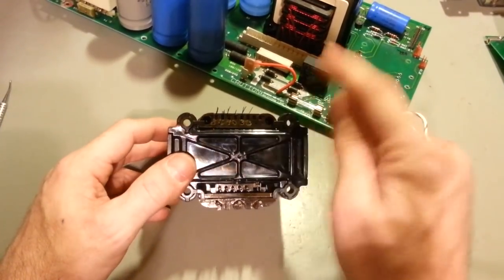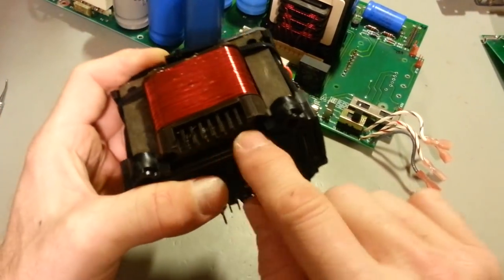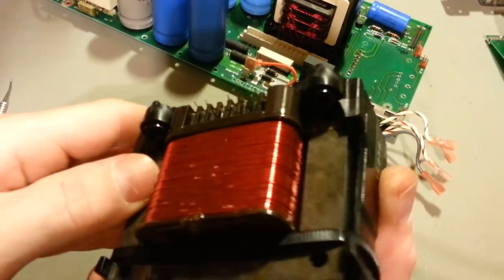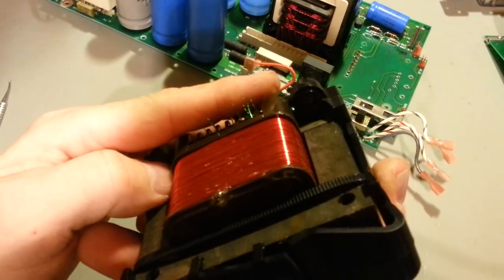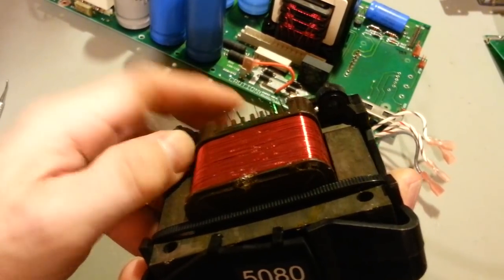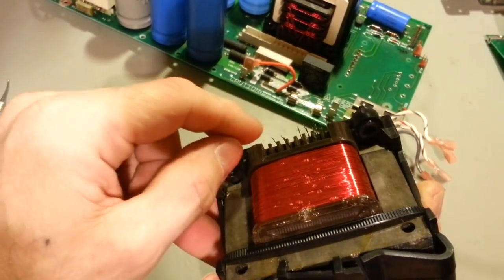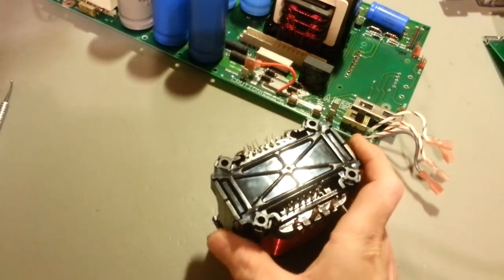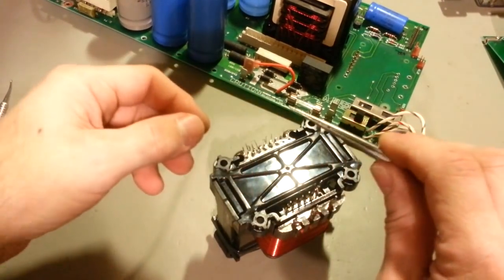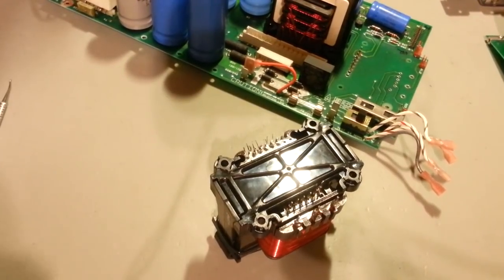I've already pried the wires up. Because of the enamel coating and the glue they have down in there, it's kind of down in there, but you can see the little green wires sticking out the bottom there. So now all I need to do is take a little bit of that enamel coating off of there, and what I'll do is solder on little loops using that same gauge of wire. I'll take probably a pair of tweezers, which is what I usually do when I'm doing stuff like this. You just take a pair of tweezers, actually, so you know what the heck I'm talking about.